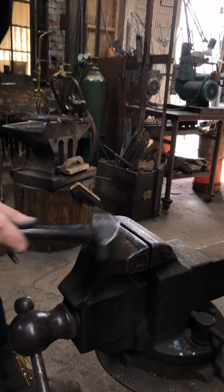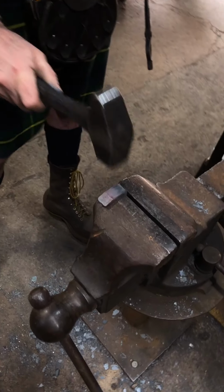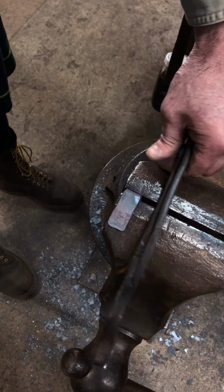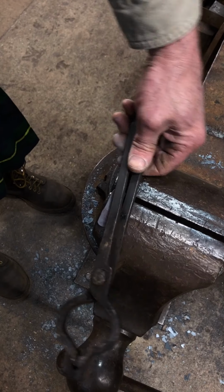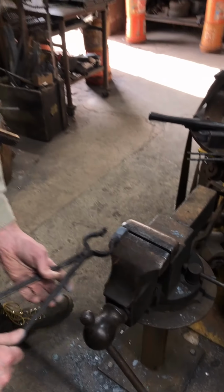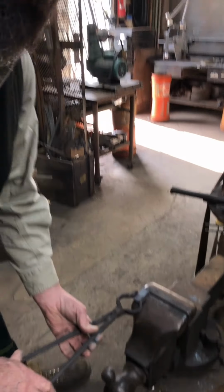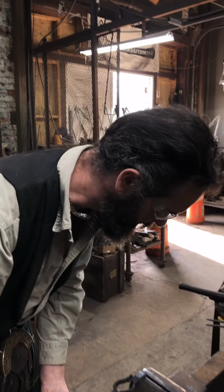That's pretty good. And when you look at it from above, you can tell that it's folded square because it's stayed true. If you had a little bit of an angle to it, fold out, it'd be leaning like this rather than true like that. Don't overfold it. Your vise jaws are generally crested, so they're coming downwards. If you overfold it, when you fold up the two pieces, they're going to be kind of opposing inwards a little bit, which can cause you some problems, especially when you go into the next step.